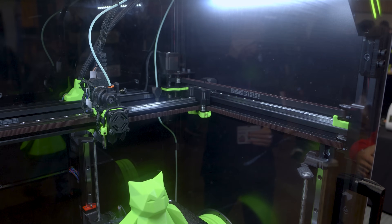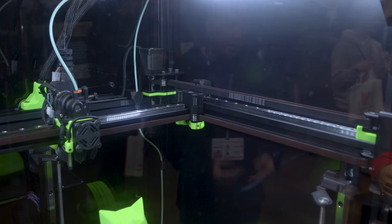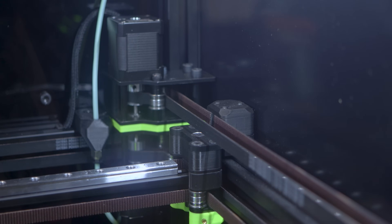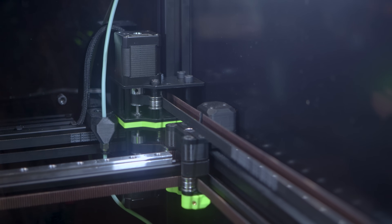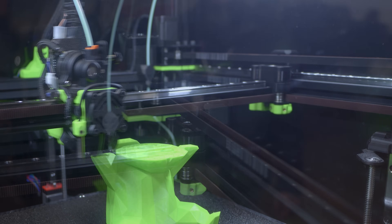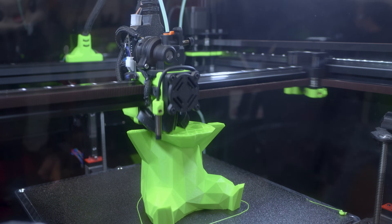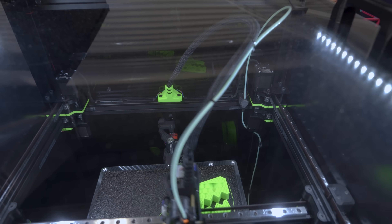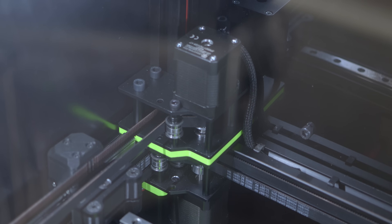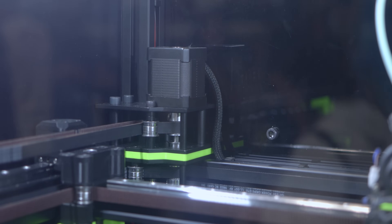Hybrid Core XY I keep explaining as Core XY plus Cartesian. It's not all-wheel drive, but it does use four motors. It has your standard Core XY as the base setup, but it has two additional motors that are not coupled to the first motors, and all they do is have a single straight forward-and-back belt path on the Y axis. The goal with this was to increase your acceleration and your input shaper graph improvements on the Y axis, as you have the weight of the gantry slinging back and forth on the linear rail. You're always going to have worse acceleration on your Y axis than your X axis, which only has to move the tool head. With the new Hybrid Core XY, they add those additional motors to provide more oomph — more horsepower to sling that Y axis back and forth.